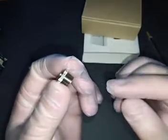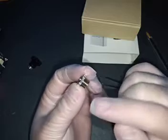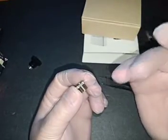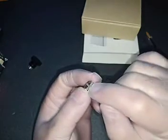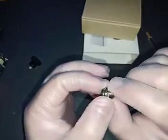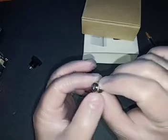Again guys, here's the best way to install it. Take that head that comes with it — it's supposed to go here. Grind it down. Machine it or however you want to do it — I just used sandpaper, back and forth until I cut the head off. Basically make it like a nut. Then screw it all the way in and use it as a washer — basically like a stopper from twisting. And that helps a lot. The laser will not move.